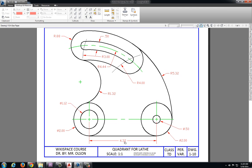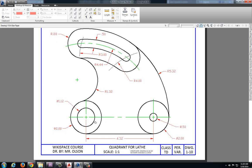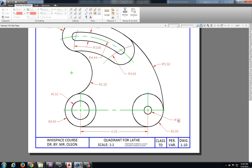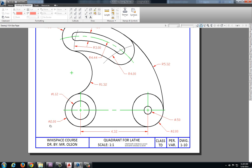I know that it is 4.32 inches away, so let's start at 4.32. I have a circle on that reference point of 1.12 diameter, and on this side I have a diameter of .50. My larger circle has a diameter of 2 inches each of these.